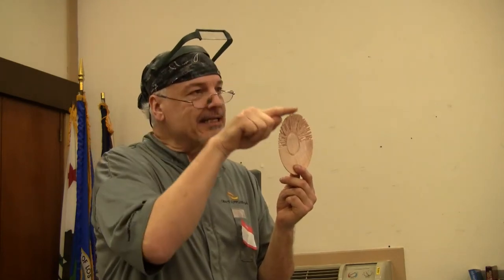Now here's another thing, a figured maple. This is done with texture. Now what I'm going to be working with primarily are three types of burrs: an 1/8 inch sphere, a 3/16 sphere, and a small dovetail. The dovetail is basically so I can follow a line and get a nice, clean, sharp edge. But if you don't have one, you can still use an 1/8 inch round sphere to follow that shape. We'll pass that around.